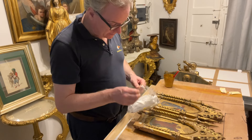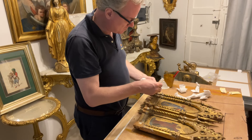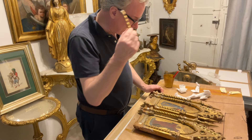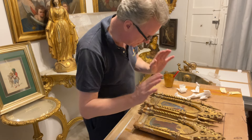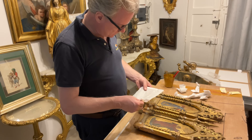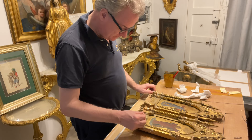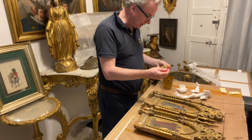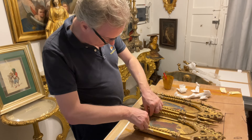I haven't seen these in the flesh — I bought them on the internet. We'll look at the damaged parts and see if we can stick them on. We have a turned column. I won't apply it yet because I have another one spare, and I will set them when both are in front of me as there will be optimal places for them. This one has mitred moulding which has come away. I think I can put that back because it's behind the other trim — I'll use one piece of hide glue and stick it in. I've been careful to get it the right way round.